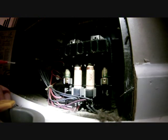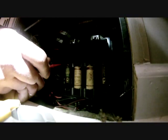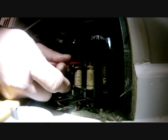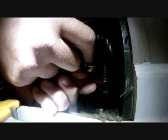Check this out — I'm a pretty big guy and that thing ain't going nowhere. Through an ungodly effort I got the pullout disconnect off. It's not melted or anything like that, it was just jammed in there. But these fuses look a little rough, so I'm going to check each one. They're all good — each one reads 0.5 or 0.4 ohms.